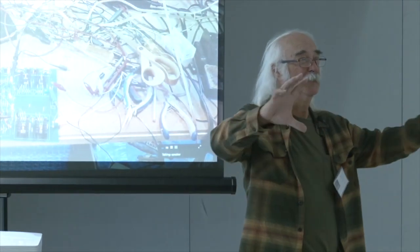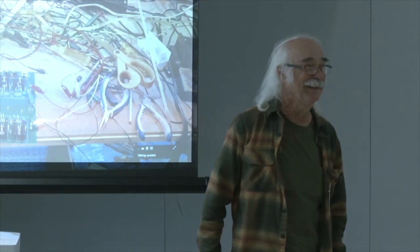So to that end, will you write that up with a Zenductor gain stage and stuff? Are you going to publish a Zenductor Beast? Yeah, I just did. I mean, you take the MOSFET out, you put in an array of JFETs, you're done. They're just running in parallel. So yeah, we'll figure that out when we know. It's just that you're literally going to be buying thousands of the J113s. You might need to match them a little bit. So there's going to be a lot of work involved.